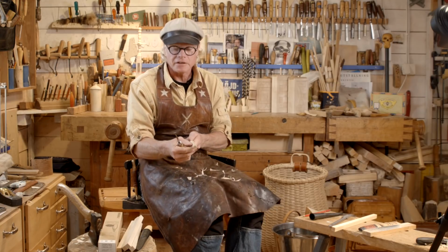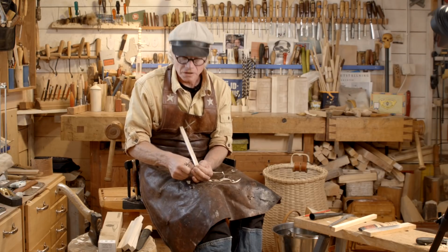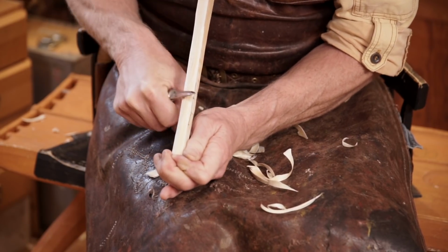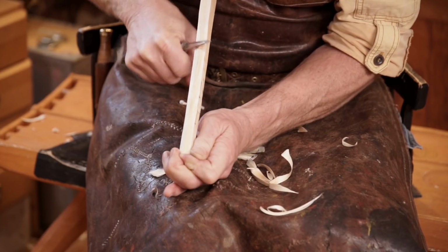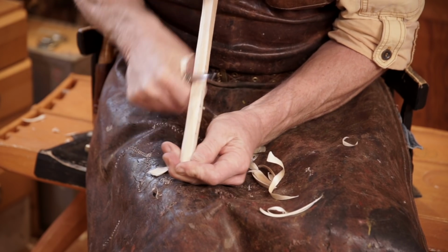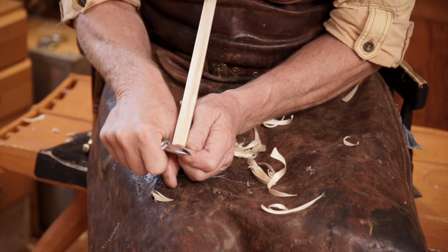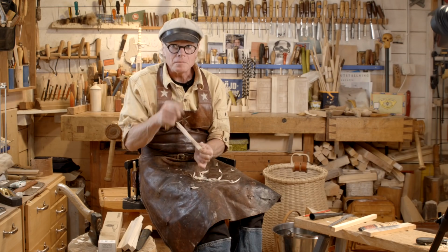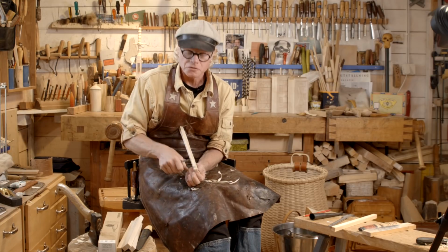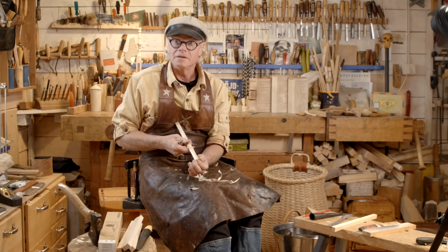And here I can very clearly feel that I have cross grain. So I have to switch to another grip and cut towards my body like this instead. And remember to flip this hand like this and hold it very gently and press it onto your body so you can feel safe and have a secure grip all the time.